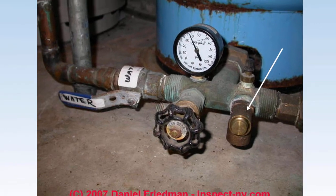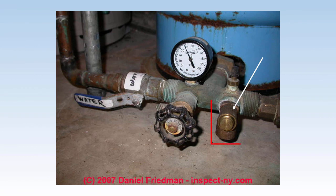As a safety measure, your system should have a pressure relief valve either on or very near the pressure tank. If your high pressure switch fails or your pump does not shut off, there can be a buildup of pressure that can damage your pump, pressure tank, or piping. Some states now require a pressure relief valve so that should a pump not kick off at the designated pressure, it doesn't cause a rupture in the tank or distribution line. The valve should be able to pass the full pump volume.